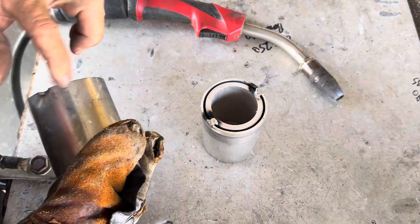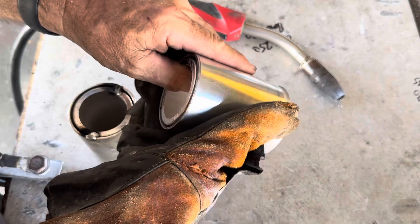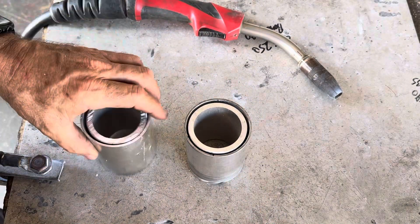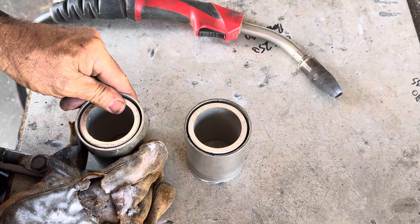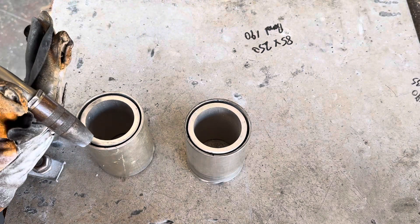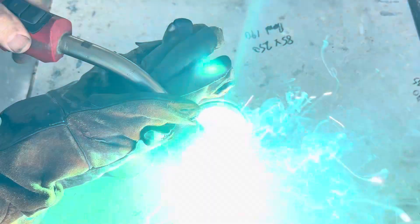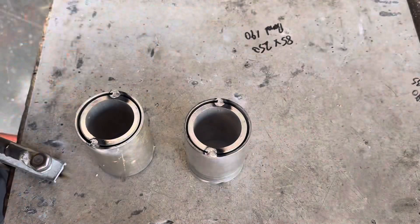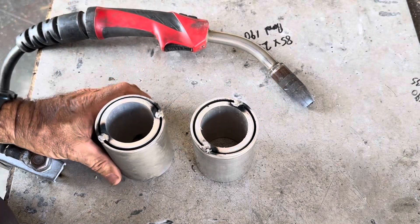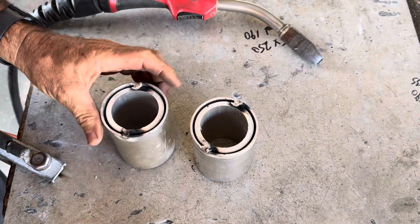I do detect there's a little bit of anodised material around the edge. These are anodised, and anodising doesn't weld as nicely as if it wasn't anodised, so I need to be a little bit careful. Put a weld on the other side as well — you can see that little bit of misalignment there, so we just realign it, get it right, like so, and put another couple of tacks on. This is with a MIG welder today — so much faster, so much quicker. When it's not necessary to have it looking beautiful, you don't get to see any of it, although we do like to strive to make things look beautiful around here.